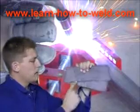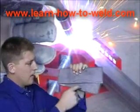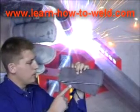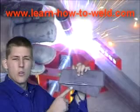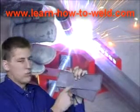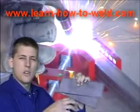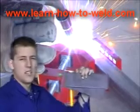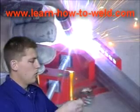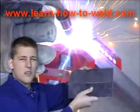I've done the right thing by hitting the edge along here with the angle grinder first just to tidy it up. These are quite clean because there's a bit of mill scale in there. You'll quite often find that the MIG welder will usually burn through that mill scale quite comfortably. It's only when your steel is really covered in dirt and mud and rust that you will have troubles. But for the purpose of the demonstration I'll do the right thing, knock off all the mill scale just so you know that it's perfectly clean. There's less chance of things going wrong then.